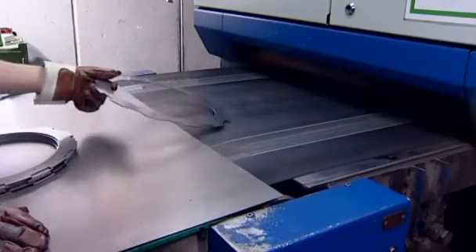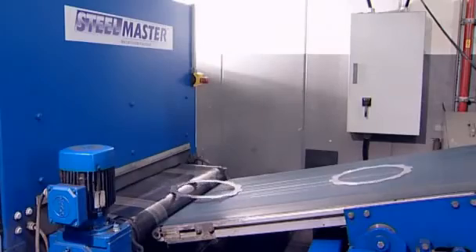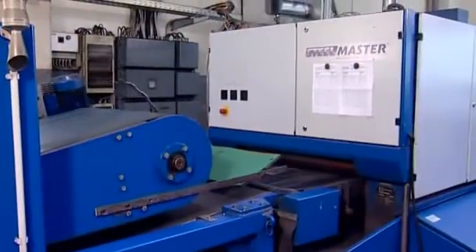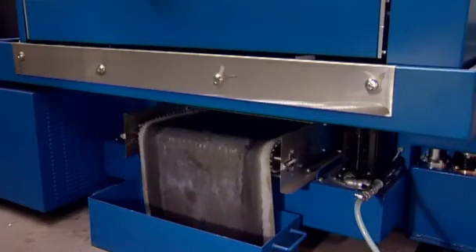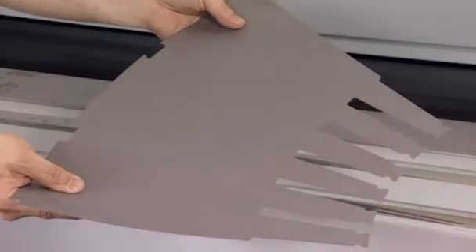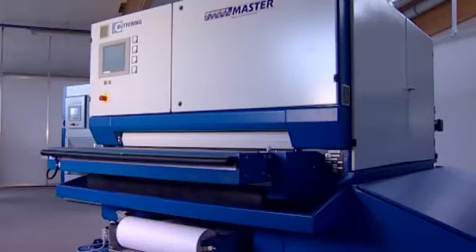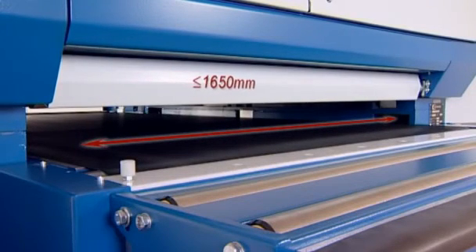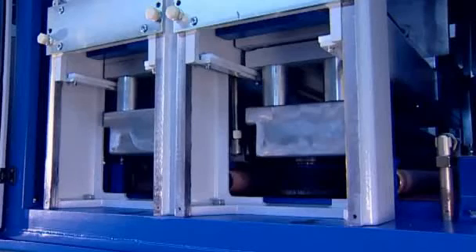Wet grinding is used for grinding different materials in one machine. No removed material is carried on through the machine, and there is no danger of explosion. Dust particles are directly bound in a circulating emulsion, and the warping of thin metal sheets is excluded. For wet grinding, the SPW series is unrivaled, as it is equipped with ECS technology and is available with working widths of up to 1650 mm. Up to four grinding or brush units, which can be arranged in any combination one after another, give a perfect finish.